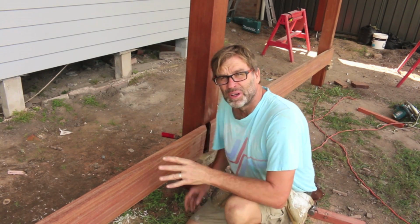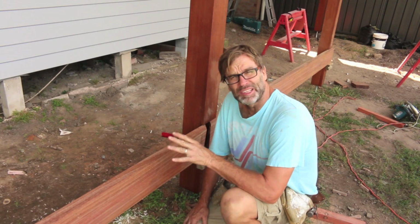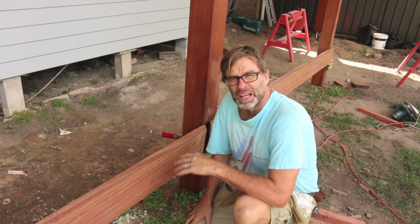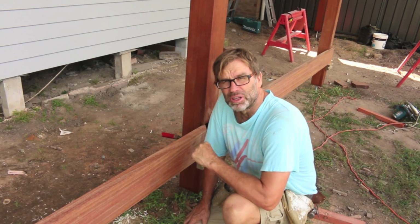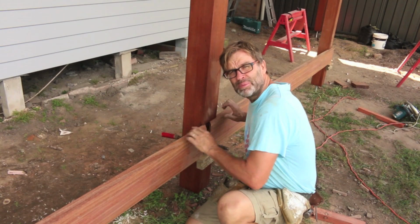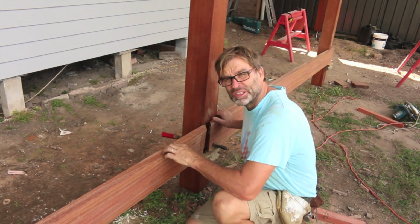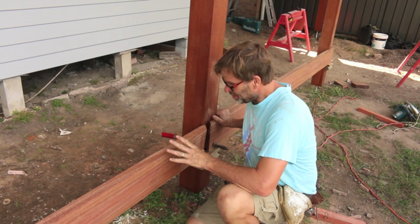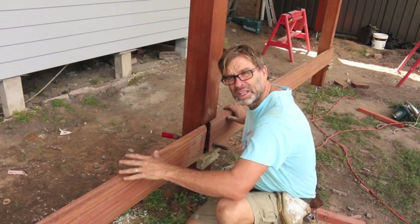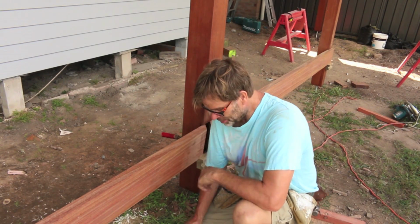Just a few seconds ago, this beam was a big 6 metre length. I put it in place last night, but there's a huge bow in it, so I clamped it under pressure and hoped that overnight it would relieve some of that bow. I came back today and put this beam in that checkout there, but the pressure from this beam was pushing upwards because I heard the roof creak. So unfortunately I've had to cut this beam, and now instead of one nice long length, it's two pieces. But anyway, that's what you have to do sometimes.